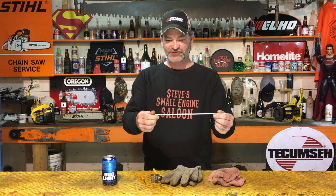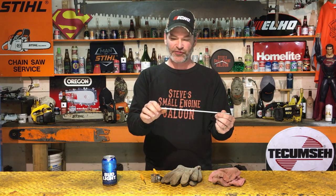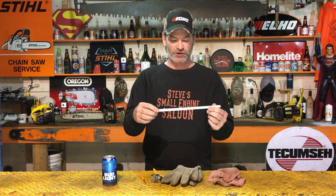I'm going to put on some leather gloves and use a hacksaw blade — a fine hacksaw blade, 32 teeth per inch. Very fine. That's what I'm going to try today to see if this actually works. I'm going to cut two slots in the end of those adjusting screws so I can use that little flat screwdriver to get this job accomplished.